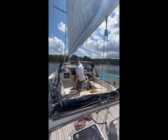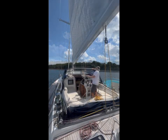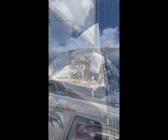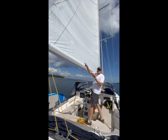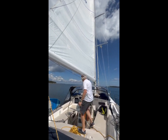Now the foot is a lot tighter — it's like a flattening reef. Got it, okay. So you have an outhaul in there, but that only works when you've got full sail up. Exactly — what I've done is tightened it up. We used to have flattening reefs in the old days on race boats. It's a pretty nice shaped sail — if I release the auto release it'd be like easing the outhaul on a race boat.